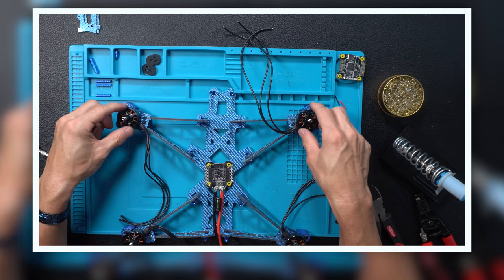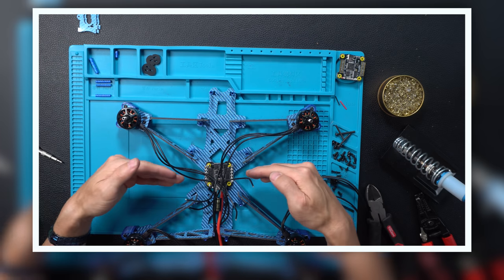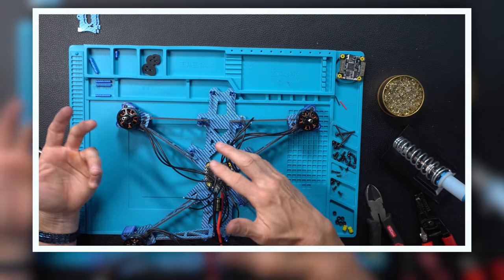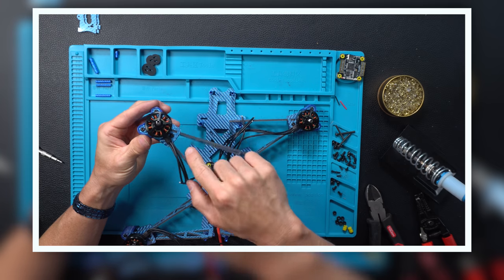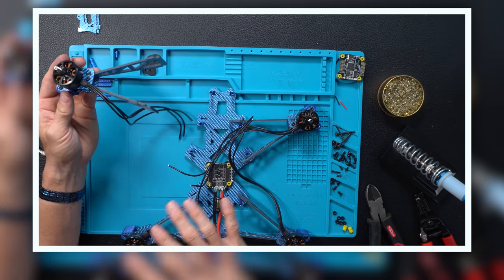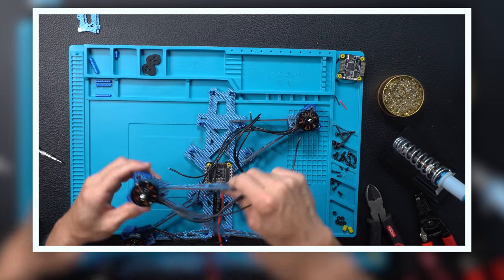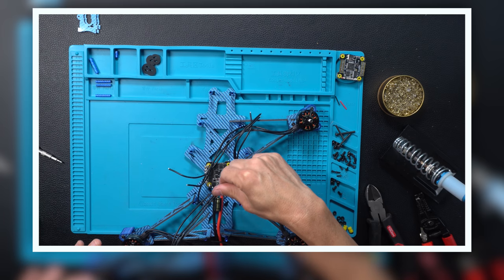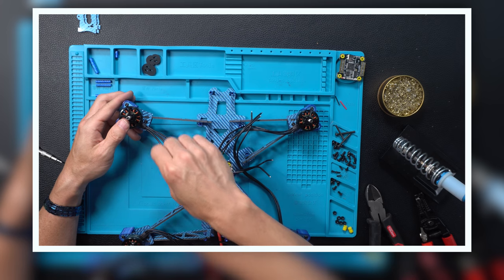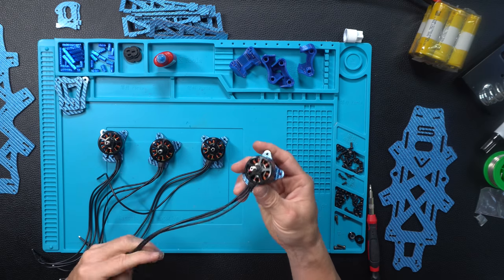Brandon from the future here: when assembling the motors to the plates, notice how for each motor on each arm the wires are actually to the inside of the truss, which leads towards the ESC. When you go to assemble the truss arms or motor plate, they're all pretty symmetrical — there's not really a top, bottom, left, or right. However, with the motor plate, depending on what side you mount it on, the wires will be either to the left or right side. I got lucky with three out of four — I could get them all going to the inside. Otherwise you'd have one that's outside and would have to cross over to get to the inside. There may be an actual top and bottom depending on what side you're putting it on, so all the wires lead to the inner part of the arm where your ESC is going to be. All four done, a little Loctite on each one, they all spin nice and free.